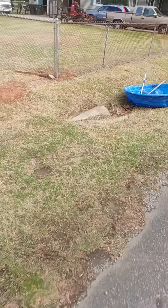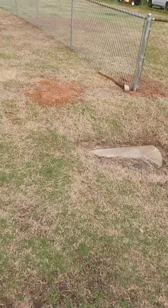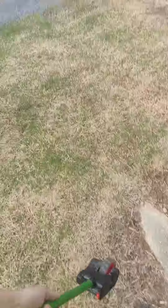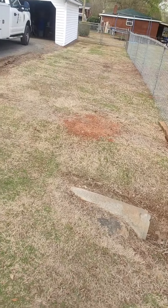We're gonna be putting in a 12 foot by 62 foot drive here, basically off the building. It comes right to the edge of the culvert, so we're just gonna backfill it with some of the gravel and fill up concrete on the edges so it don't spill out, and haul off the organics.